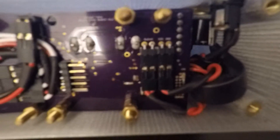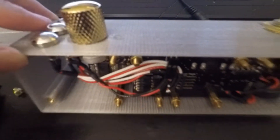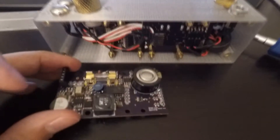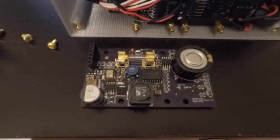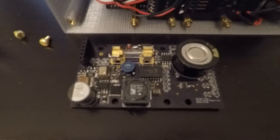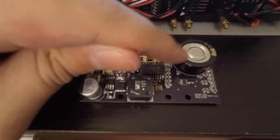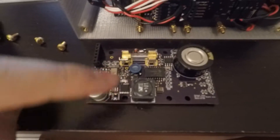You can see the ferrite core — I just have a floating one instead of a screw-down one. Here is the base electronics board, which does the whole boost converter and power regulation, and everything involving the microcontrollers. Here's the PIC, here's the clock chip, here's the super capacitor, a bunch of power stuff, and the boost converters in this corner.